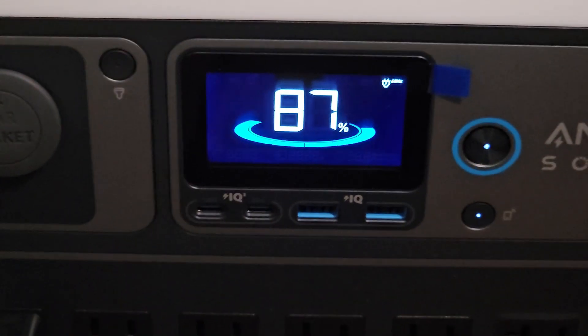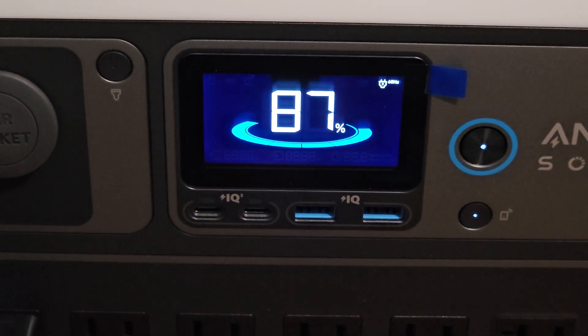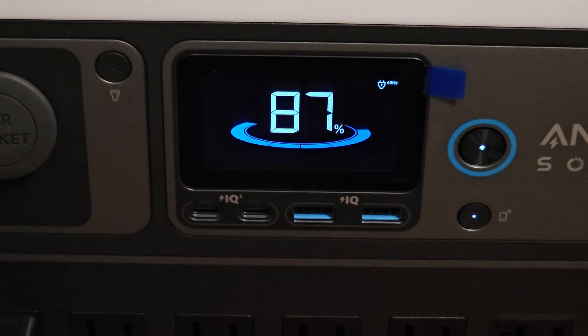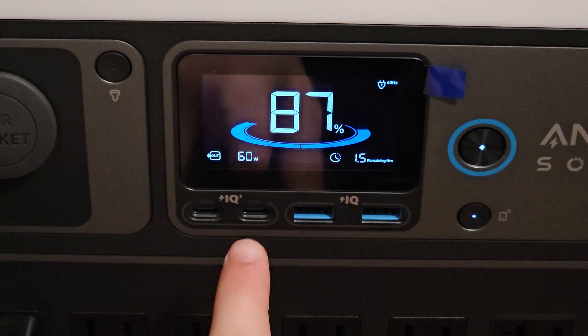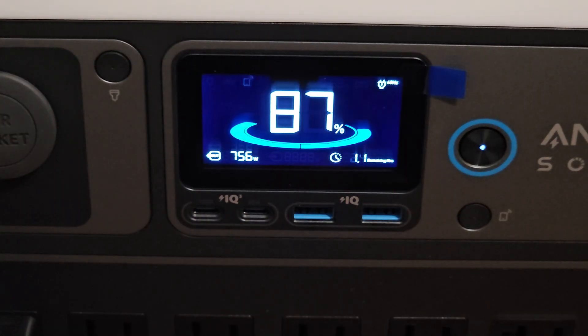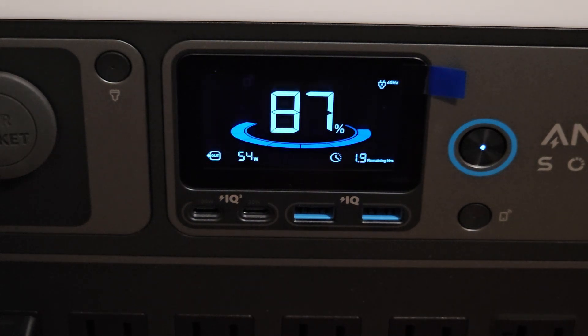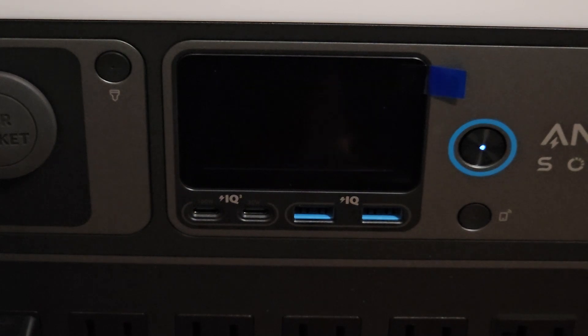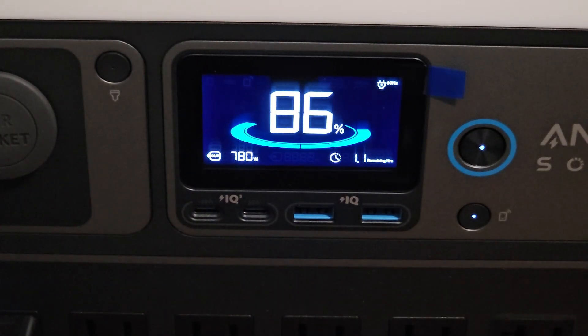Keep a look at this screen - I'm gonna heat up the bed and nozzle at the same time. I'll put the nozzle at 120 Celsius and the bed at 60 Celsius. Let's see - 60 watts, 51 watts. Let's put the bed at 70°C - look at that, it jumped to 756 watts, almost 1000 watts! Let's put the nozzle up to 200. Let's put the bed to 85 - 54 watts then 792 watts. Wow, almost 800.